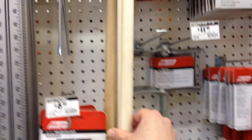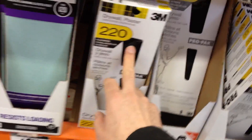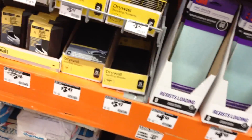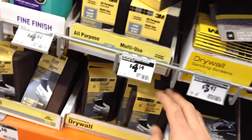When you're done, you need to sand. These poles are good for sanding ceilings or higher walls — you put some sandpaper on the end. They come in different grits. This screen mesh style is what I like to use. Regular sandpaper can get loaded with joint compound if it's not dry, so you've got to wait for it to dry before sanding. These sponges with sandpaper on them are really good for corners — they help square up and clean up the inside corners of the walls.